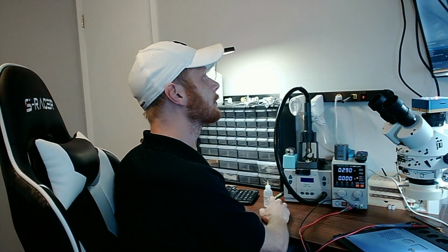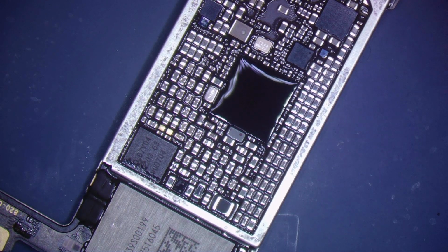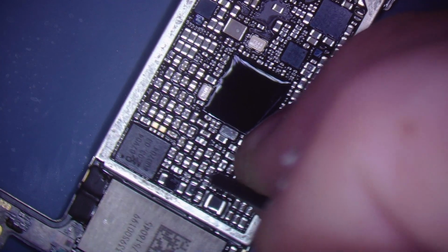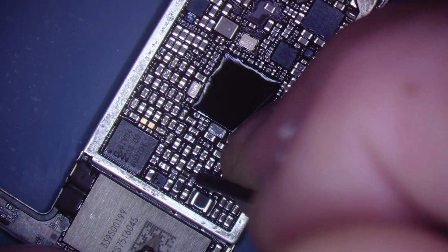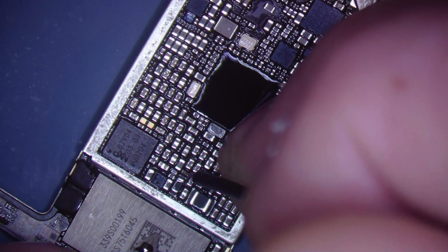Alrighty, and we'll switch you guys over. Inject some voltage into that cap. Actually, this cap literally, I didn't see the PMIC get hot, but this cap literally was moving around a second ago. Wow. All right, that cap is definitely getting so hot, it's desoldering itself from the board.